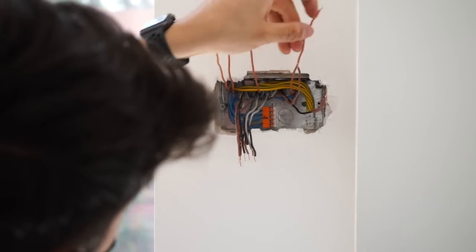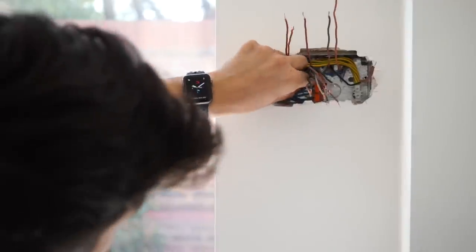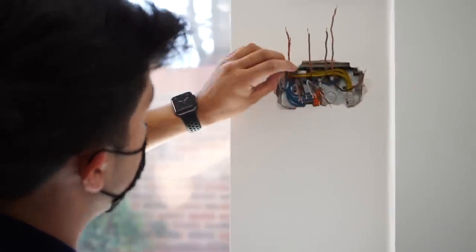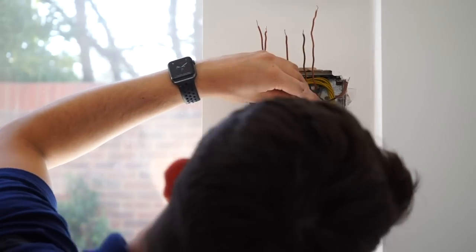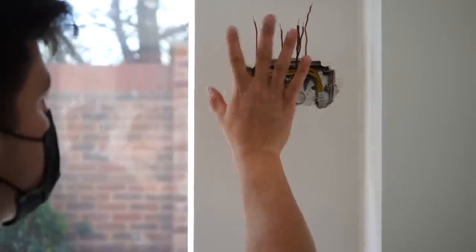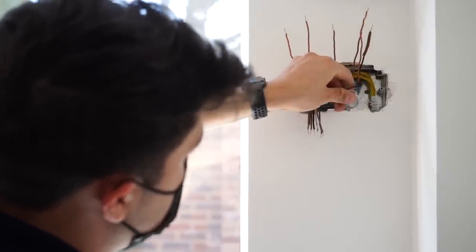I've been separating this out and tidying up a little bit. I've reconnected the earths because I didn't like the baggy horrible earth sleeving or how it was crammed in. I've reconnected the neutrals into a WAGO in the back - I've used a snap-in one because I'm not sure exactly what's doing what yet, so I might have to take them out again. I think that's a two-way, and that is a two-way as well. Feed-in, feed-out, outside lights, permanent for outside lights, hallway lights upstairs - something like that.